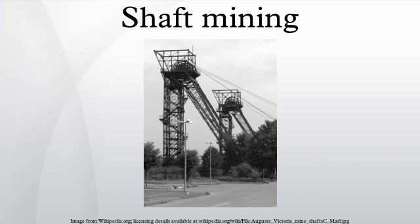The lowest shaft station is most often the point where rock leaves the mine levels and is transferred to the shaft. If so, a loading pocket is excavated on one side of the shaft at this location to allow transfer facilities to be built. Beneath the lowest shaft station, the shaft continues on for some distance; this area is referred to as the shaft bottom. A tunnel called a ramp typically connects the bottom of the shaft with the rest of the mine. This ramp often contains the mine's water handling facility, called the sump, as water will naturally flow to the lowest point in the mine.